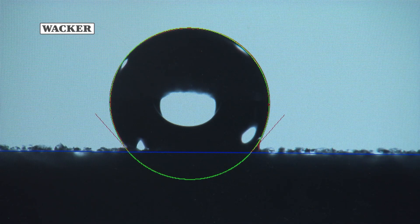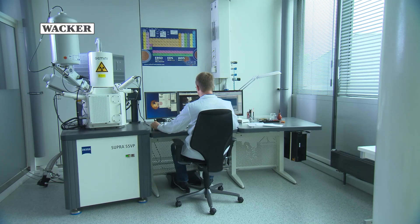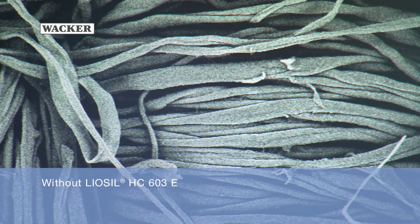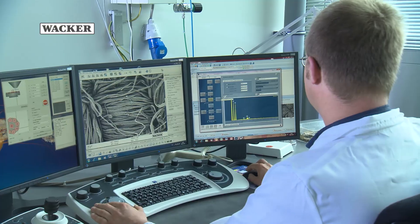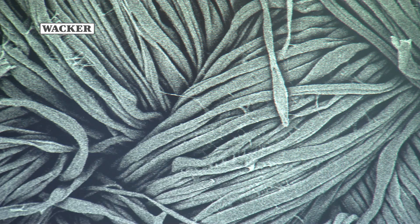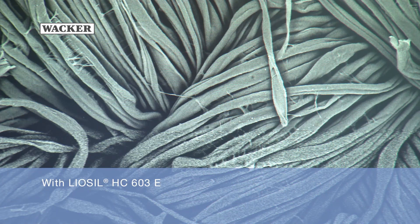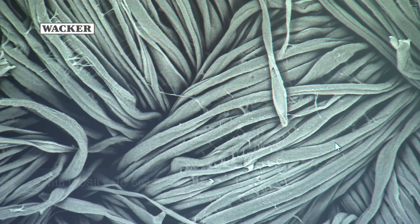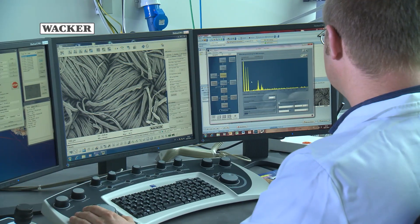Structure and surface quality of the fabric — in this case cotton — can be seen under a scanning electron microscope. Comparisons with untreated textiles show that Leosil HC-603E uniformly affixes to fibres without adherence. Elemental analysis by microprobe X-ray spectrometer confirms the presence of silicone substances on the surface of the fibres.